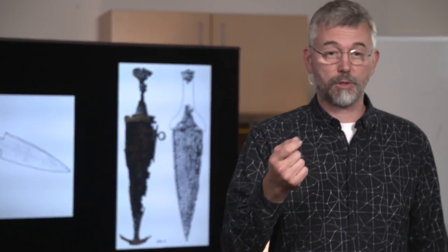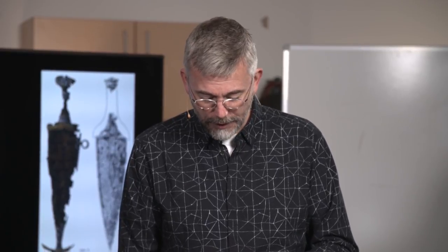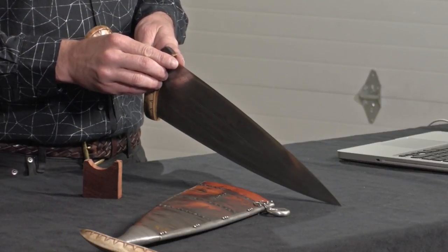I keep the tang and blade in pace with each other because I want the shoulder area of the blade to be the thickest, so the tang tapers away from that and the blade tapers away from that. I'm careful not to go too narrow in forging down the edge, because if I do, I will have only a paper-thin wafer of steel edge down the middle of the blade. I keep the edge still a little bit thick — around three millimeters. The back of the knife is around seven millimeters as ground; when I forged it out it may have been around seven and a half or eight.